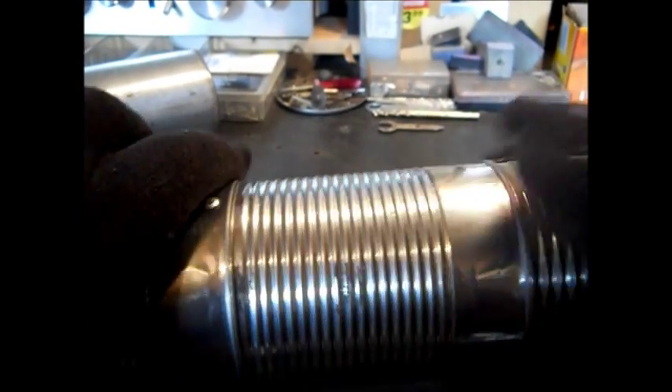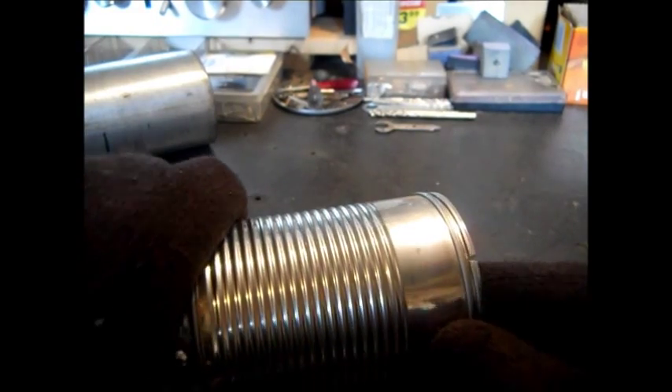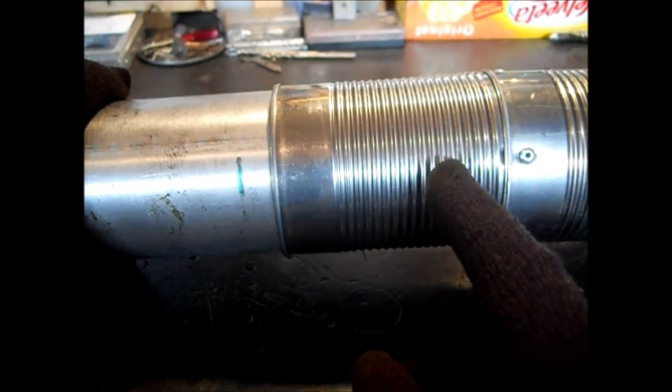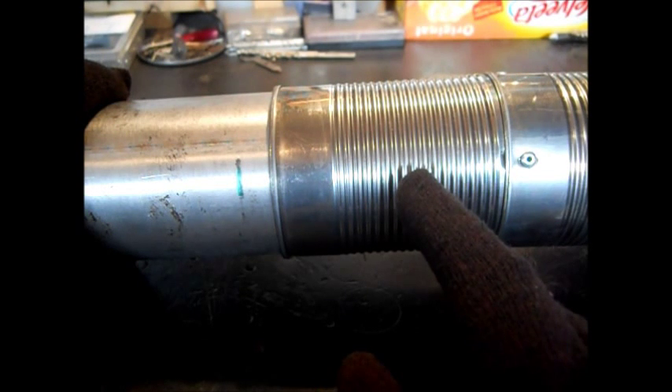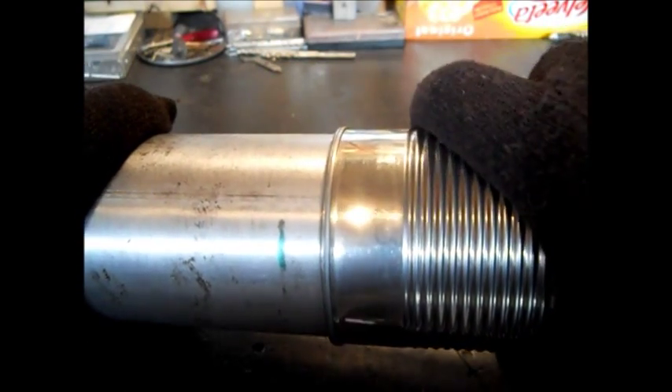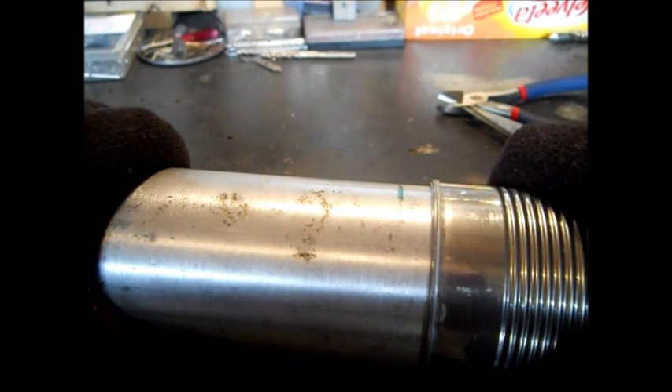Let's say this is three inches. We'll make sure to have our rivets down to where it grabs the inner can. We did mark this three inches, but we're probably going to only go about two and a half inches, because we'll have our rivets half inch down on the can. We're going to use long rivets — we may use four, we may use six. We do not want this to ever go past there. This took up the slack, playing out to be a nice stove pipe.